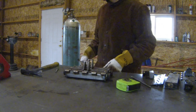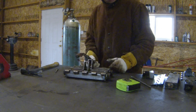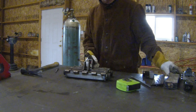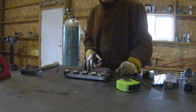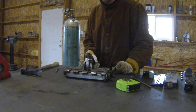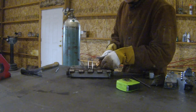It's important to weld down the sides for added strength. When I originally built the metal hinge with teeth welded to it, I had wood pads and I only welded just the ends of the track teeth. The torque of turning on the track caused quite a few of them to break off, so I learned it's best to weld all the way around the tooth.